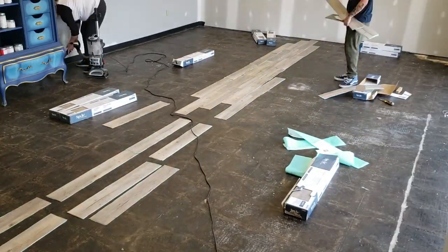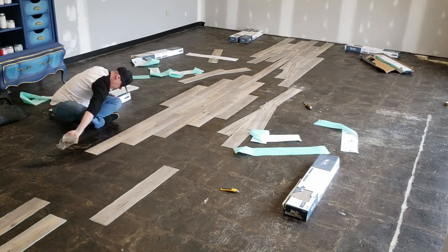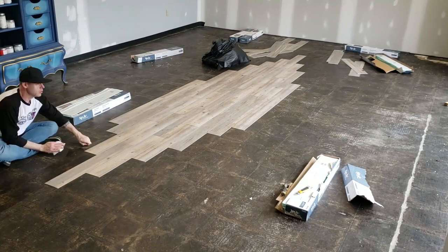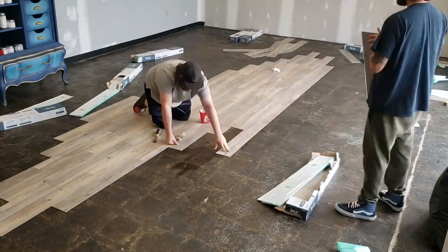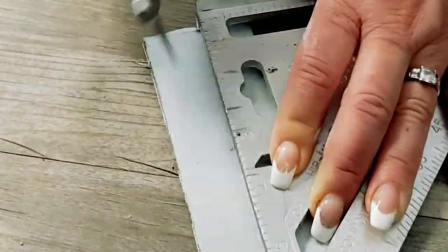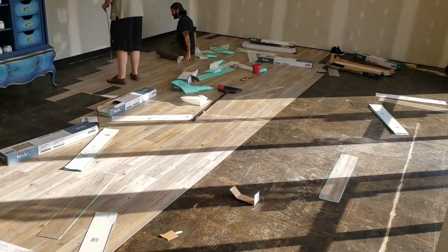Step two: replace the floor. We're using vinyl plank flooring here — Style Selections barnwood plank tiles. It's peel and stick, just like giant stickers. I did have to start in the center and get all my staggering correct so I could Tom Sawyer the kids into helping lay the floor. The boys would only tile in the middle of the floor. When they got towards the wall, I had the hard job of measuring and cutting the remaining tile pieces. It was super easy — you use an exacto knife, score it and snap it.